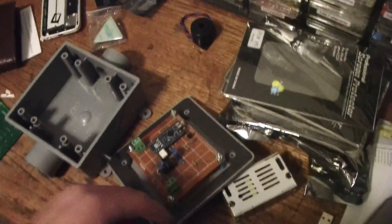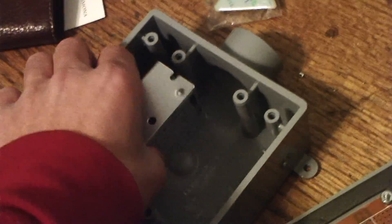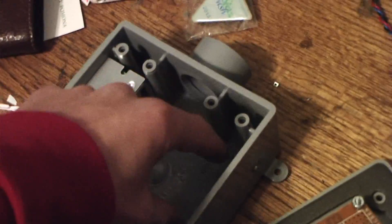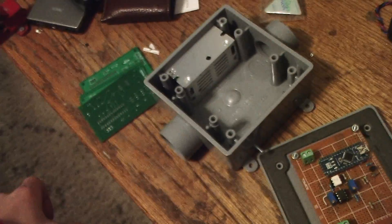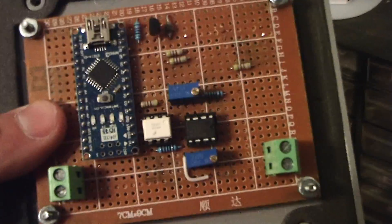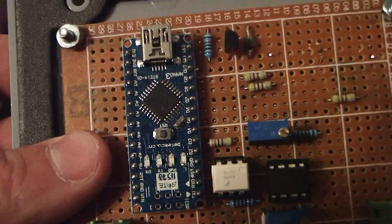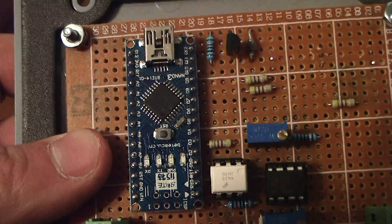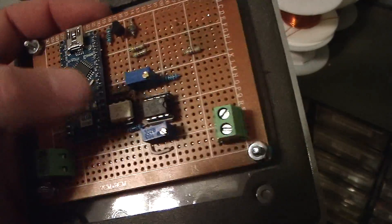You'd have 240 volts coming in, a small 1-amp 12-volt power supply, the power relay, and the J1772 cable coming out the other end. This is the prototype electronics board — same thing as the garage unit, just a little bit smaller. We have the voltage comparator, trimmer pots, and an Arduino Nano instead of the full Mega board. The Nano is capable of running all this — mainly just monitoring a few digital pins and analog voltages, and putting out PWM signals.